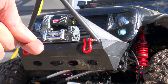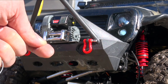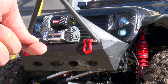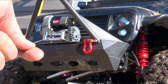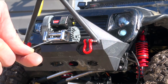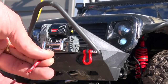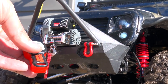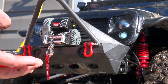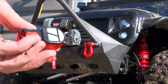I'm going to roll the rest of this line in. Since nothing is feeling hot, I want to make sure that I get a good wrap on this line through the fair lead. Because it would have been wrapped very, very tightly, I want to make sure to unstring all of this cable and then restring it again just so it's not so tight — or else next time I go to use it, it might be a problem. But there — everything is working perfect.